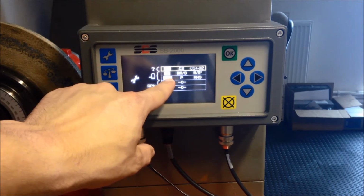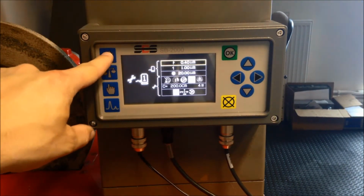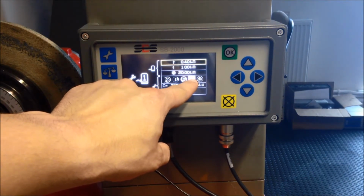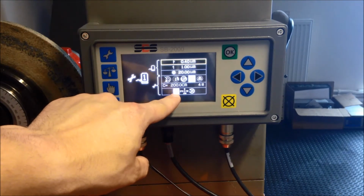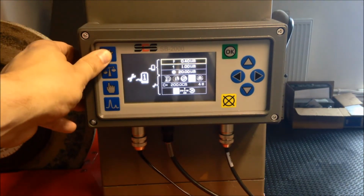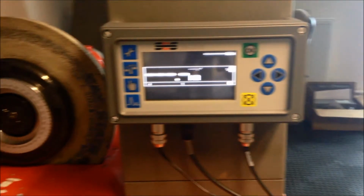For this demonstration, we have selected a 3-weight balancing solution as we're balancing a grinding wheel that has 3 weights on the flange. Angle orientation is important. In this example, the grinding wheel is rotating clockwise and the angular increments on the wheel flange are increasing in a clockwise manner. Therefore, we select equals 2. Pressing the wrench button again exits the settings.